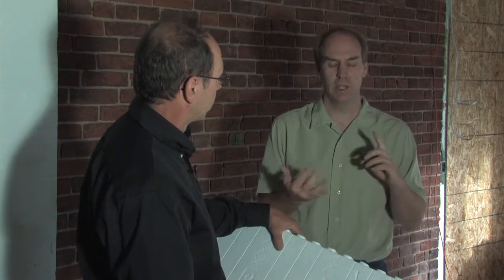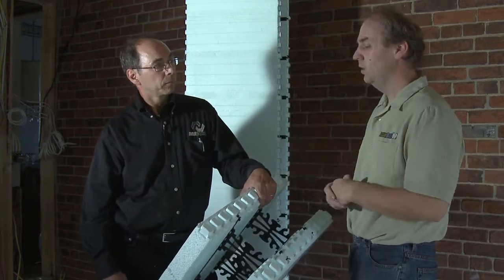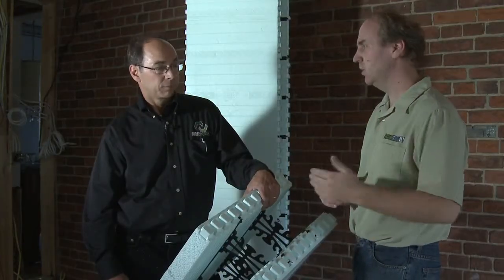So just to review: structurally, it goes up quickly. It's a solid house — wood can rot, it can get eaten up; nothing's going to eat this. The R-value, the sheer insulation value. The air infiltration control making a very tight house. And then the sound control feature. As a more urban product, to not hear traffic outside, to not hear the neighbors — it's a great feature.